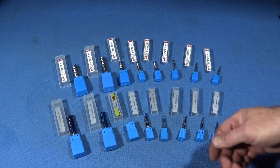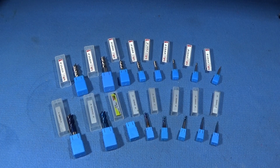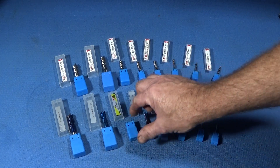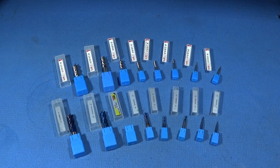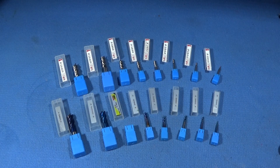The other day I did a bit of a test on this blue nano carbide end mill set which I got from Banggood. It wasn't a very fair test because I was milling something which should have been done with a fly cutter on the lathe. I haven't got a milling machine, but today I've set up my milling attachment on the Myford ML7 and I'm doing another test on an eight millimeter blue nano end mill bit, cutting a piece of stainless steel at more suitable speeds.